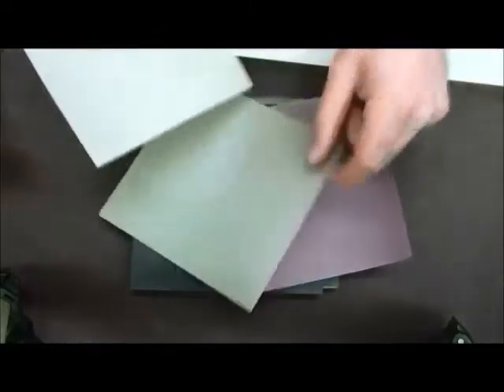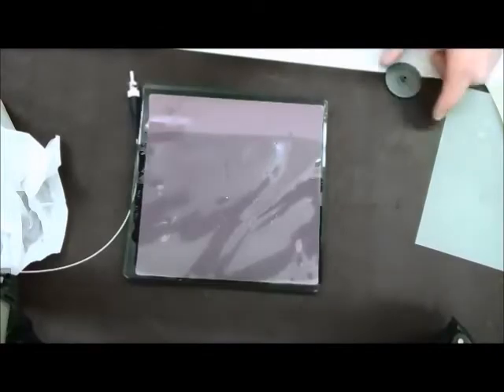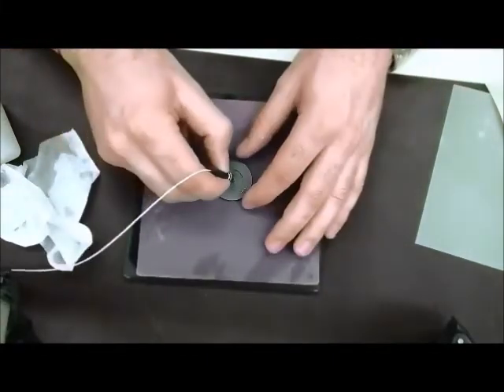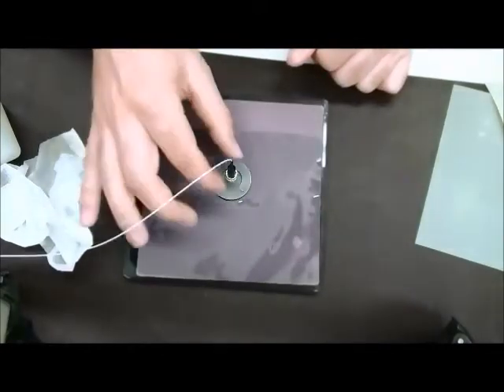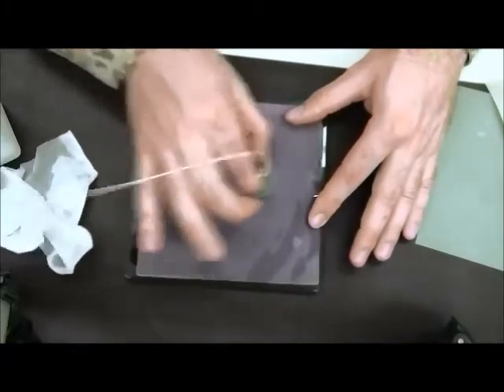Once you are done air polishing, you are going to need a glass plate, the rubber mat, the purple, the green, and the white polishing film, and also the small polishing puck. Place the purple polishing film on the rubber mat. Clean the purple polishing film with alcohol and the proper cleaning cloth, then place the ST connector inside the polishing puck. When you are polishing, grab the polishing puck — not the ST connector — and perform 10 to 12 1 to 2 inch figure 8s.